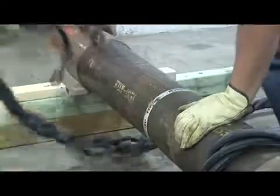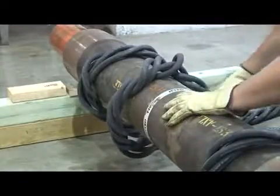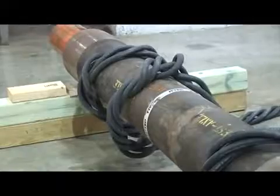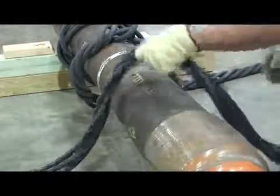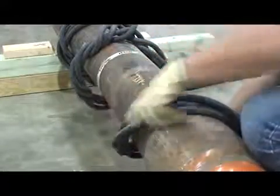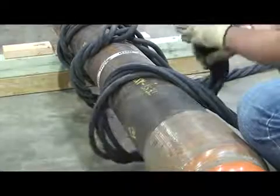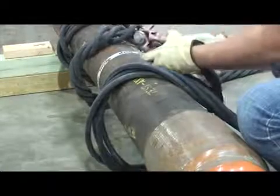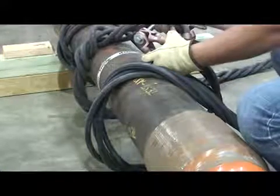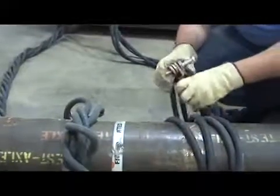Using the 4 aught cables from the left side bus bar of output 1, wrap the cable around the part to be inspected, simulating a coil. Using the 4 aught cables from the right side bus bar of output 1, wrap that cable around the part to be inspected, simulating a coil, and close enough to connect to the other 4 aught cables already wrapped. The connections from both sides of output 1 now need to be connected.